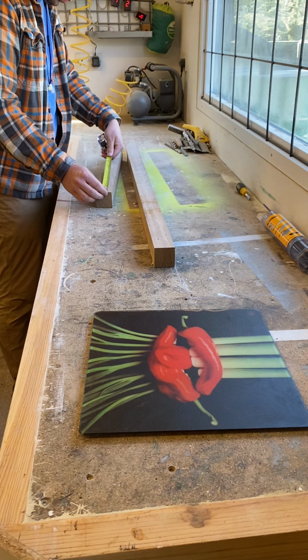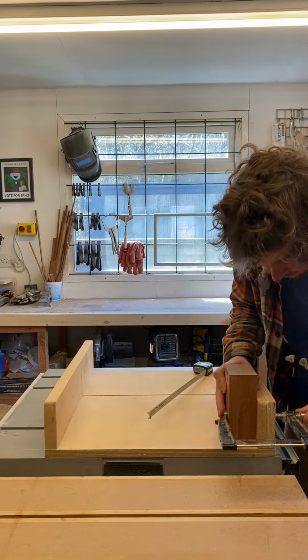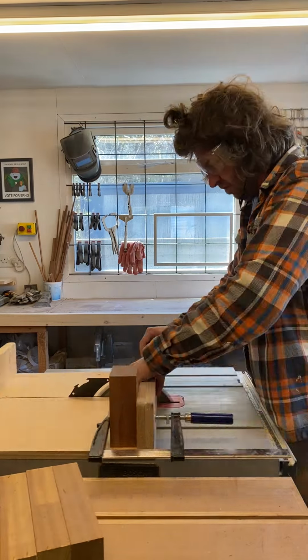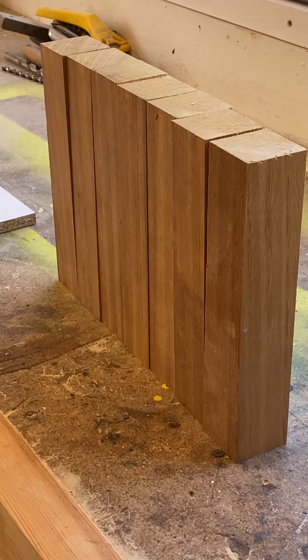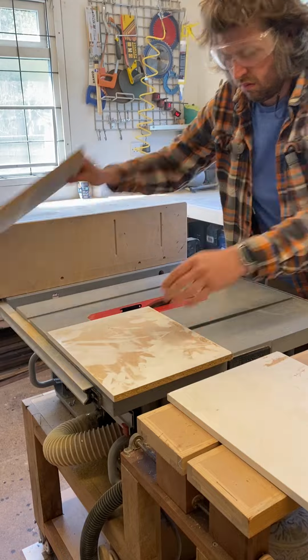I had a little bit of Iroko left over from the legs I made for my desk drawers. So I measured it up and worked out that I needed to make a 7x7 grid from it to make an end grain board the size of the glass one. I set a depth stop on my cross-cutting sled and cut myself 7 even pieces. Then realised gluing this up would be a good use of the melamine chipboard I was about to throw out.